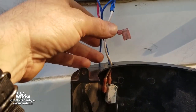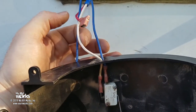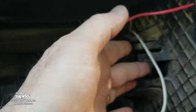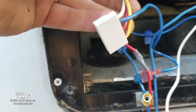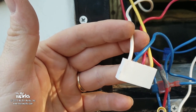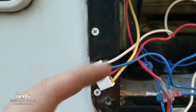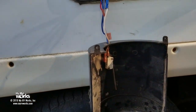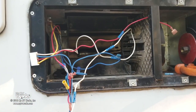So on this, here's the back of the blower wheel. We have a blue wire and a white wire. This blue wire feeding the sail switch is coming from the thermostat. So the thermostat calls for heat, it goes to my sail switch, it leaves on this white wire, the white wire follows up back to my high limit thermostat, comes back on the other white wire, and then goes into my control board — here's my wiring harness feeding the control board. So this white wire took a journey: it started at the thermostat, went through the sail switch, went through the high limit thermostat, and now it's telling the control board that the high limit thermostat has not opened — it hasn't gotten too hot — and the sail switch is proving there is airflow.